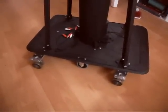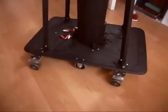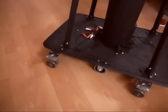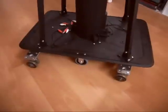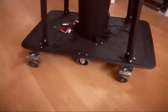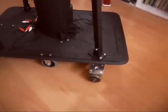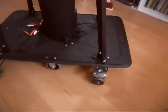The trolley has a nice mid-wheel support so it's very stable and does not interfere whether on rails or off rails. We have a swing arm in the front and a swing arm in the back, which allows us to create very tight radius — we can go around a circle of about one to one and a half meters. When off-track, you lock the rear swing arm in place and the front swing arm is fully motorized so it can navigate left, right, and center.